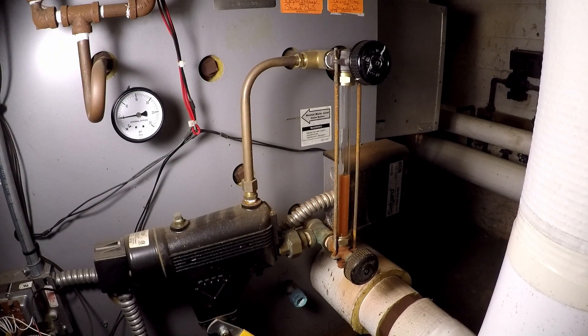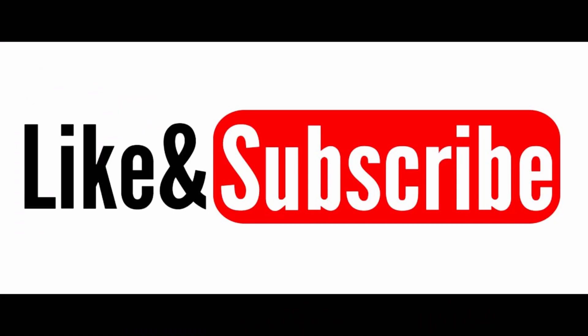That gauge on the left-hand side started off at around two and didn't go all the way down to zero. I completely flushed the system and it is operational again. Sometimes in that little pigtail to the left of the gauge, you can get some junk in there as well. Make sure you flush your systems every once in a while to get that junk out. Here's a little time lapse of the water level building up pressure and using it for the first time. Pretty easy. I bought three sight glasses just in case I made a mistake, and I kept the original as well. Hope this helps — like and subscribe, and happy holidays to everybody!